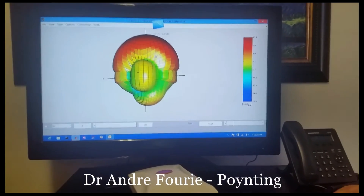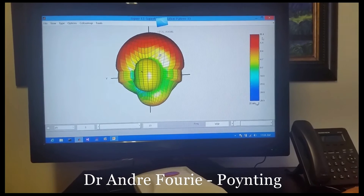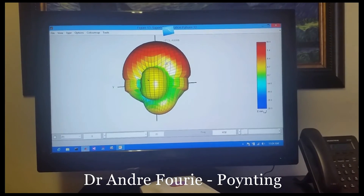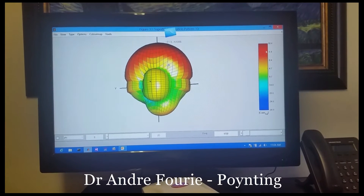At the bottom of the band, at 1732 MHz, the gain at the top is about 10.4 dBi. Where you see it going towards lighter orange is the 3 dB point, which would be about 7 dBi.